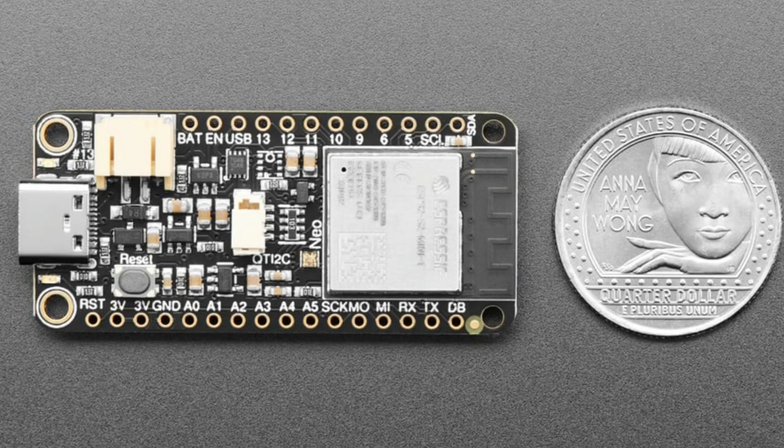There's a NeoPixel on board with a secondary regulator so you can turn off power to it. The STEMMA QT port also has a secondary regulator so you can depower sensors for ultra low power usage. We're using the RT9080 regulator on these boards, which means power goes down to around 30 to 40 microamperes in deep sleep mode. Hackaday has a low power contest with DigiKey — you could use an Adafruit product and probably win. We will eventually do an S3 version as well.